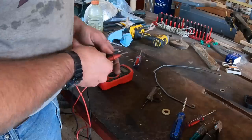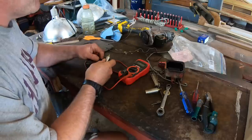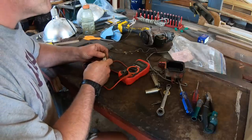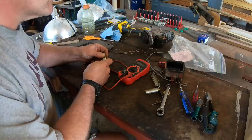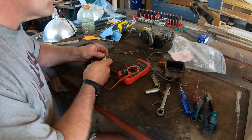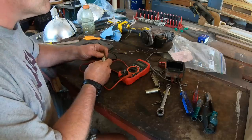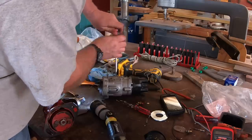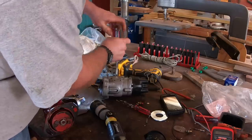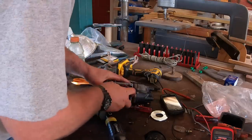The problem is, I don't have a foolproof way to test the coil — it requires a special tester to really know if it's good or bad. I do have a method to test the condenser with a multimeter. I set the multimeter to its highest ohm setting and put the leads on it. Resistance should rise as the condenser stores electricity — after all, condenser is just another word for capacitor. And it does, so the condenser seems to be fine. Lacking a way to test the coil, but I really suspect that's the problem by process of elimination, I go get a spare magneto and swap out the coil.